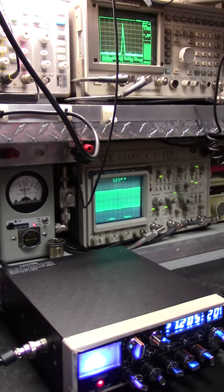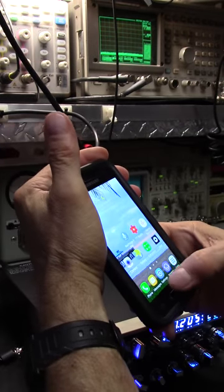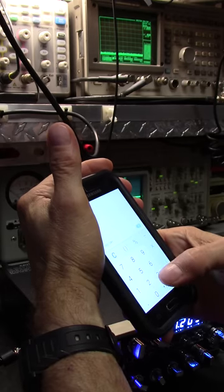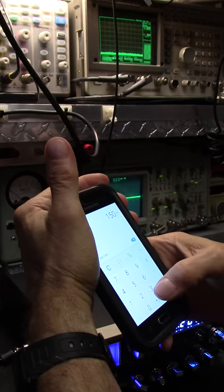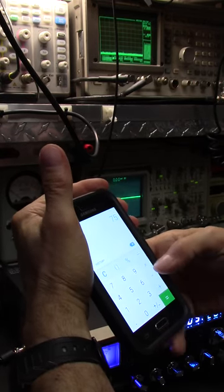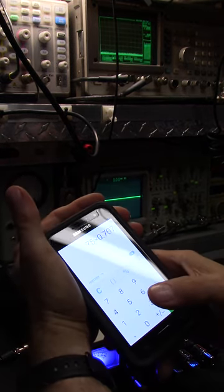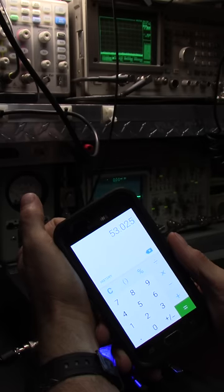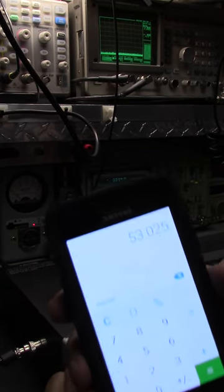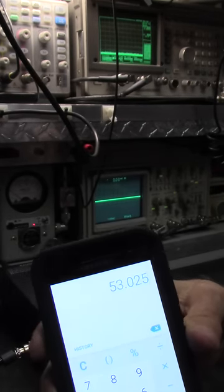So that's 150. So 150 divided by 2 equals, we know that is 75 times 0.707, RMS effective power, equals, okay? See it? Is the camera picking that up or not? So this can easily do 50 continuous.